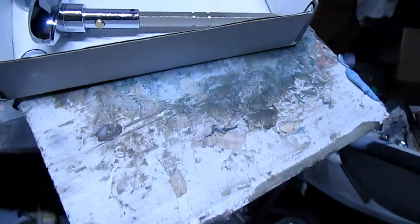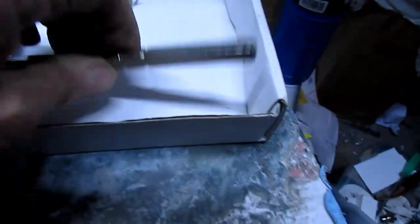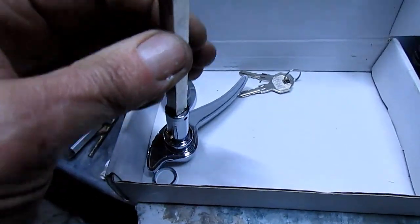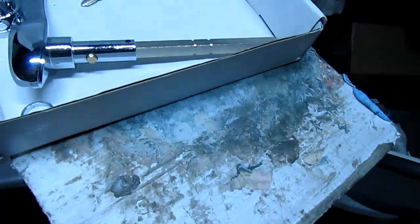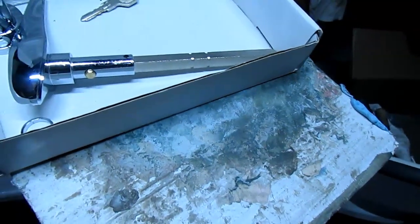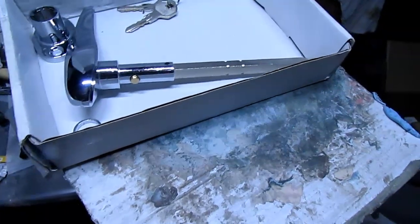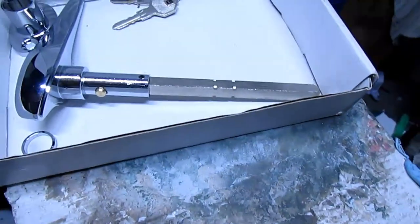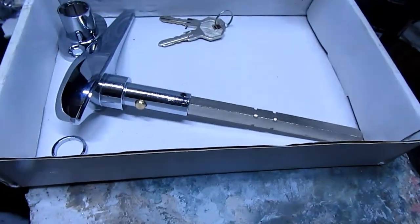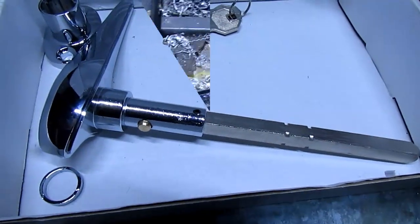And I'm pretty sure this will be like a 7/16 nut. I can put 2 on it for a lock nut. That way I can adjust how tight it squishes together without a lot of trouble. And I think a big nut on the outside would be a lot stronger than one on the inside. So I'll punch this apart and see if I can set me up a collet here for the lathe.